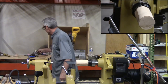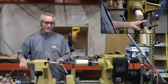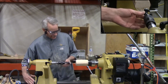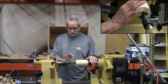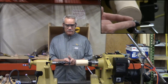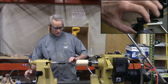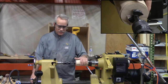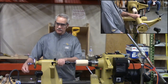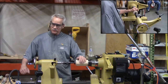The very first thing I need to do is drill some holes. The kit I'm using is the deluxe kit from Craft Supply. The manufacturer says this hole needs to be one and five-eighths inch diameter by a half inch deep. My bit is a half inch wide, so I can just drill until the backside of the bit is flush with the wood. On my lathe, I don't measure — I just count the number of revolutions once the wings start cutting. I don't have the bit touching the wood before starting — I let the bit center itself and register first.